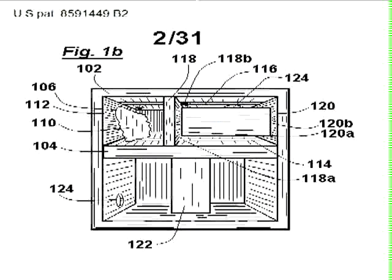Alright, here we have one of those boxy embodiments I mentioned. I won't bother describing it except to point out some features of it. This area right here is a flexible plastic bag containing hydraulic fluid. This middle part is a partition that goes up and down, and it slides along in a groove right here. This square right here is some sort of elastically deformable material, as is this square down here. That could be a spring or a gas cylinder.